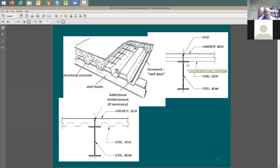This section is cut through the girder and this section is cutting through the beam. If you cut through the beam, from this side you see just a couple of lines - the metal deck going from here to there and then concrete topping above it. In this section you have two lines for the metal deck and then the concrete right there. In this section you're cutting through a girder coming this way, while in this section you're looking at the beam from this location.